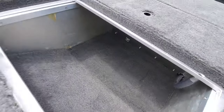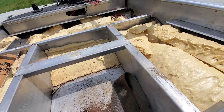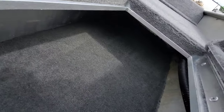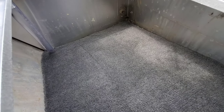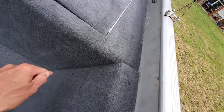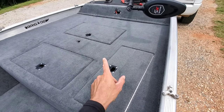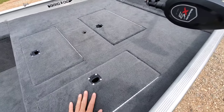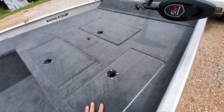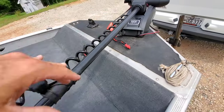In here, all I did was carpet, and of course you've got that divider. This area in the factory setup was just solid wood with foam underneath it. I was able to gut a majority of the foam and create another storage space in here. The dry hatch on this side runs down and around and behind this panel. There's a low spot on each side of the boat for water to direct to the back. We added a hatch there, a hatch there, a divider, retained the seat pedestal, dropped the factory hatch down, inset it into custom framing, re-decked and re-carpeted everything. I also moved the throttle control cable entry up front so his trolling motor cable can come out there. It turned out really nice.